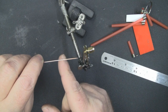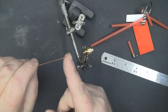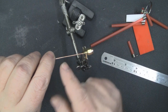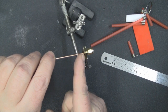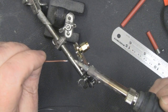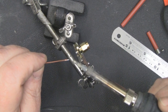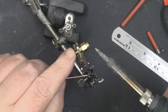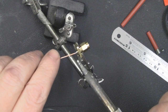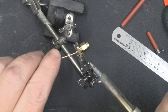I'm ready to solder the driven element onto the bulkhead connector. I've tapered and sharpened the end with a Dremel so it goes nicely into the solder cup for a strong connection. I'm not measuring until it's soldered in — I'll take the measurement including the solder cup for a clean result. I apply a tiny amount of solder to the tapered end and a small amount into the solder cup, then hold them together and reflow — giving a really strong connection without excess solder mess.